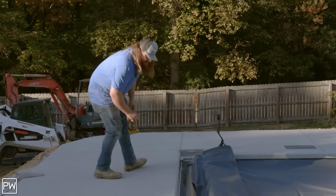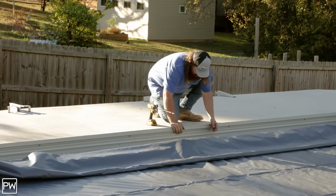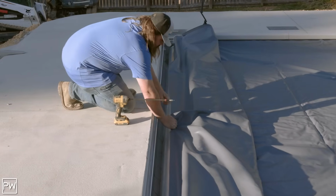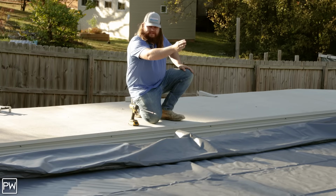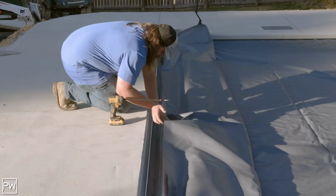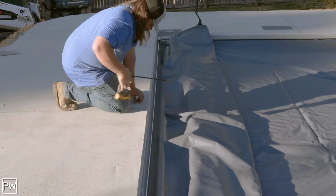Next, we're gonna go right to the middle of the cover. Get our screw ready. Now here, we're gonna have some extra slack, okay? Pull all of our slack from both sides, straight to the center. If you need to know we're at the center, you can always check with that warning label at the end of the fabric. Centered here, split the difference. We want equal amount of slack on either side of where we're gonna put this screw, keeping it straight in line with the others. There's our center screw.